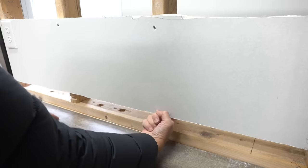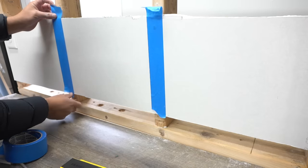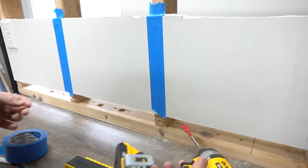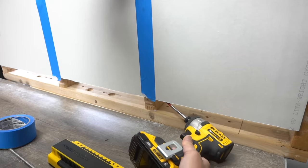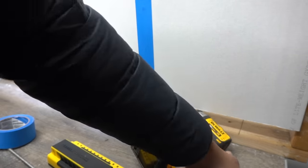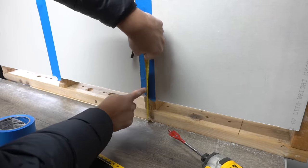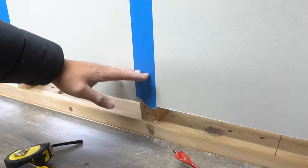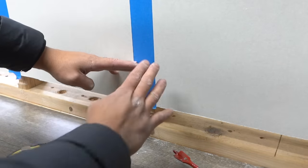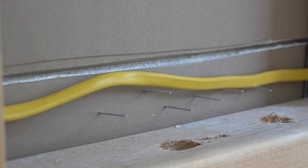The better and safer option: drill the hole up above the stud, a little bit higher than your cut-off line — this is just for demonstration purposes so you know where the studs are located. Take your spade bit — this is a six-inch spade bit — and go at it at an angle. The only problem with this method is that when you're going at an angle, you can only go up to about five inches above the floor. So if someone wants to install higher baseboards, there's still a possibility a brad nail could hit that wire.